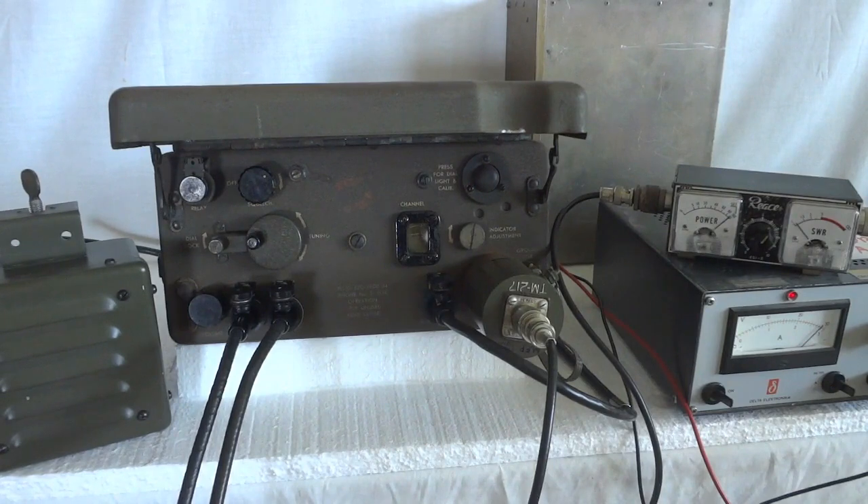M35: How does the modulation sound for the BC-1000? Over. — Sounds quite well, works excellent — hard to believe it's 76 years old. The people who originally designed it are all gone now, but they sure did a good job. It was designed by Galvin — now Motorola — in 1942, in a very short time from concept to production using nothing but paper, slide rulers, and their wits. An excellent design, way ahead of its time — the first portable FM manpack radio, and together with the BC-611 handy talkie, the most famous World War II radio in existence. I did have to replace all 40 of the 10 nanofarad bypass capacitors to get it working again — they were all leaking — but it now works to factory specifications.